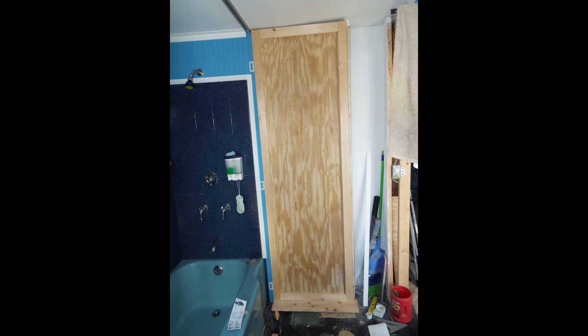As we showed in an earlier chapter, we've got that wall covered in white paint and boxed on the right-hand side around the old heat run. Between the tub surround and that first 2x4 on the right, we built a simple door — nothing more than the beadboard we were using on the wall and 1x4 boards that were pocket-screwed together. The first time we swung the door around to the tub, we found it couldn't open fully at 90 degrees because of the shower track on the ceiling. So the door had to come off and we cut a little bit of the frame away so that it would clear the track and give us 90 degrees of opening.